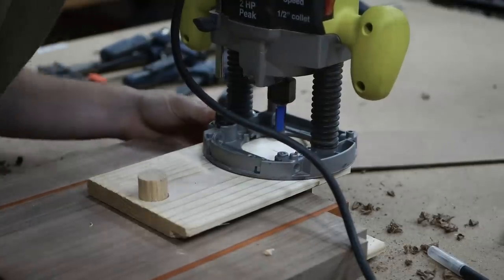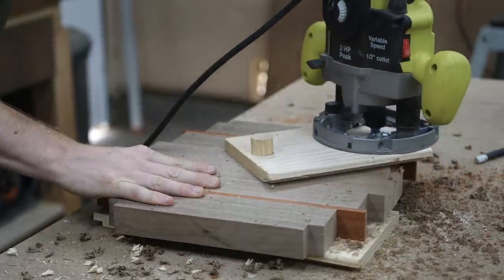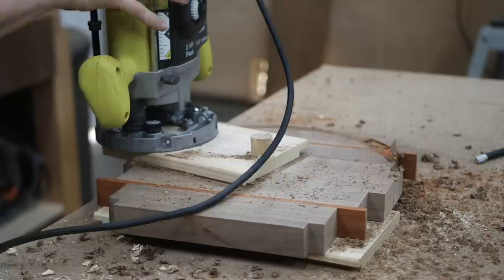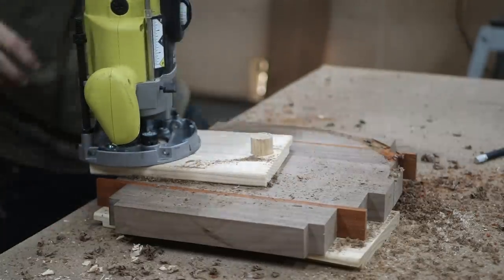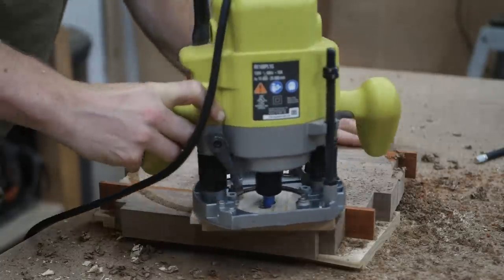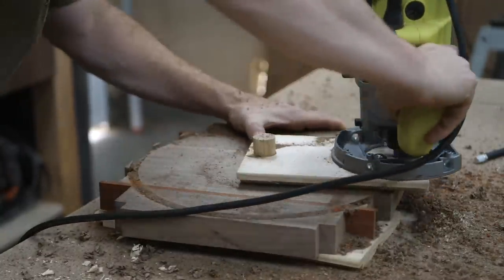Now I quickly realized hardboard wasn't thick enough to accept screws to attach my router to it, so I redid it with a thin piece of redwood I had on hand and attached my router to it. Once everything was secured, I could turn on and plunge the router as deep as possible through the jig and into the seat and route out a perfect circle.